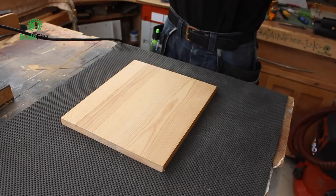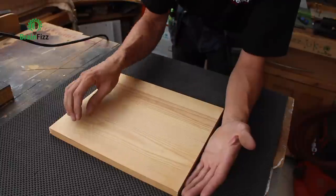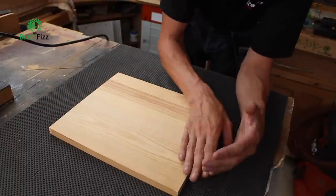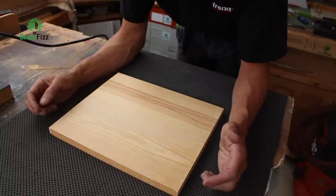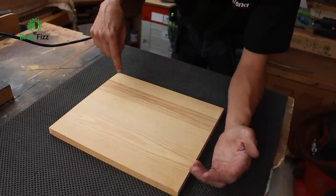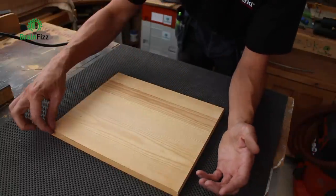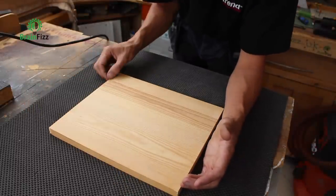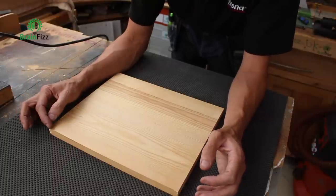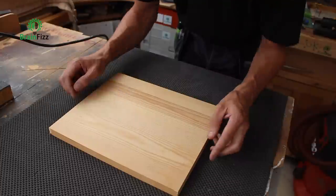Because this is solid wood with a grain direction — or it could be plywood with face veneers — I'm going to start routing on the end grain. It doesn't matter which end grain I start on because I'm going to do all of them. But there is a chance, just like with a mitre saw or chop saw, that the cutter will tend to chip the end fibres. If I do the end grain last and it chips, it'll chip out on my finished edge. If I do it first, then come across and machine the long-grain profile, any breakout on the corners will be absorbed by the following machining process.